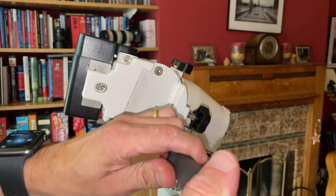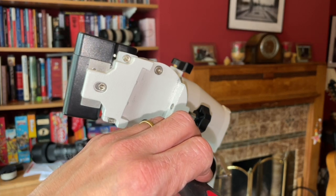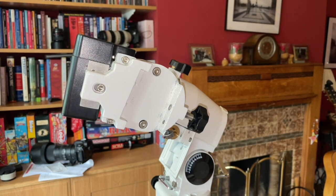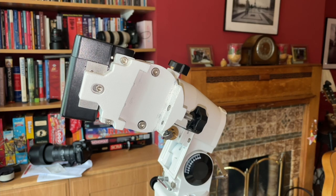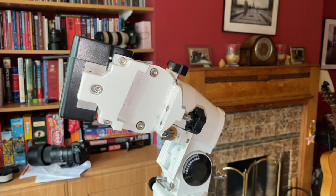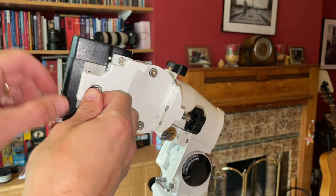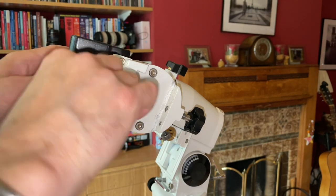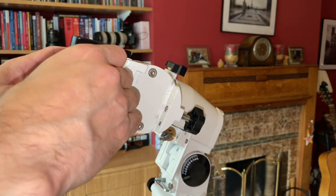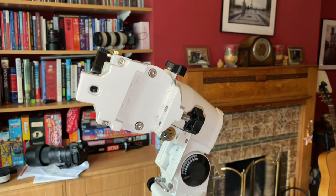What we're doing now is just removing the top of the declination part of the mount where you fix the telescope to. These bolts I think were sort of 5 millimetre bolts, and then you've got a 4 mil allen bolt that keeps the declination motor in place. This is something I had problems with quite some time ago where basically the declination motor had slipped off the gear and caused me a world of problems until I realized what was going on. So we're just going to use that 4 millimetre allen key to remove the declination motor, and then we can take the mount plate off.